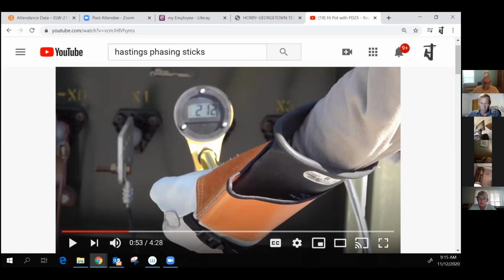When you hook up a brand new 120/240 single phase transformer, you're probably going to get 122, 123. But when you start applying electrical services to it and people start consuming off of it, it does come back down to the mid-range voltage around 119, 120. So I just want to give that information. Carry on there, Professor V. Okay.